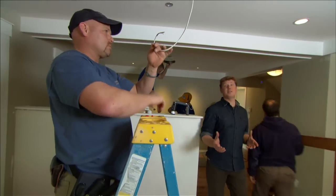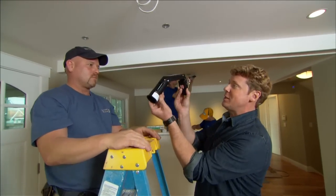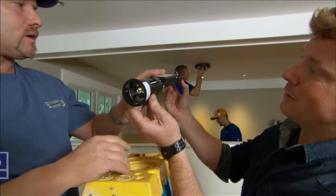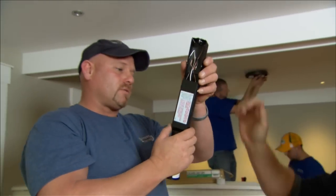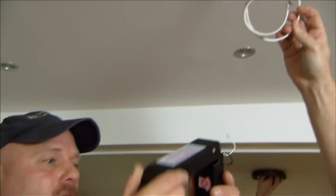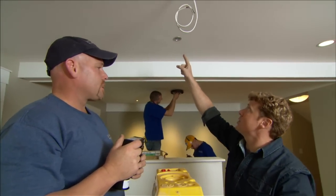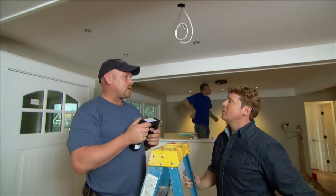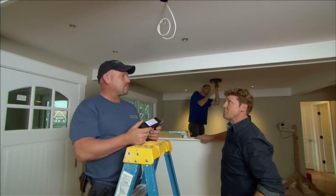Our electrician John Butterfield is down to the last few fixtures, and one of them is something I've never seen before. This is the latest in LED diode technology — we've got the LED on one side, the driver, and the opening to wire it. The snake shape makes it electrician-friendly: it fits into a small 2⅛-inch hole, is very flexible, can go around any obstruction, and can lie flat or angled. We used this retrofit-style fixture because the lighting designer Evelyn and John didn't know where the beams or cabinetry would wind up — this gives the ability to maneuver it into different areas.